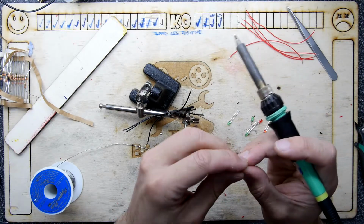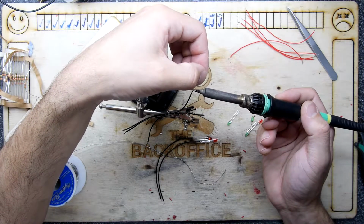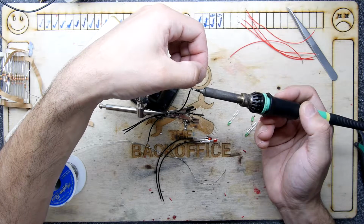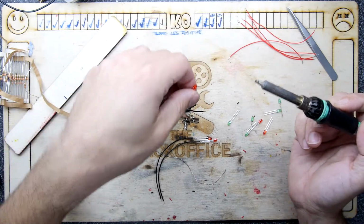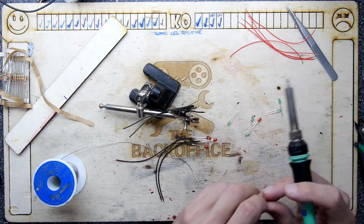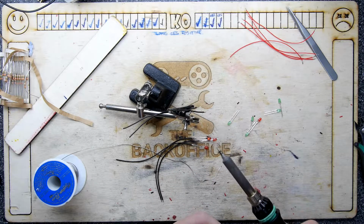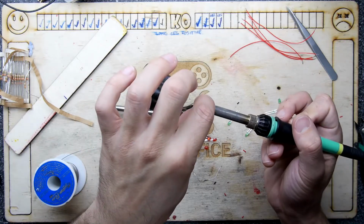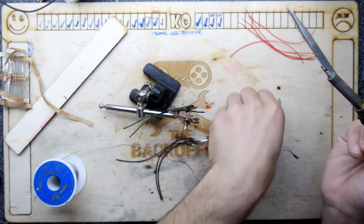And the appropriate command in the terminal is the modem hangup, which is +++, you know, ATH. You'll be used to this, the usual place, and that'll put it back into the AT command mode. So there's no real reason at all to have the reset button, and it's really horrible to fit. It's probably the worst component on the whole board other than the USB port to fit. Micro USBs, by the way, are a real bugger. They're a horrible thing to hand fit.